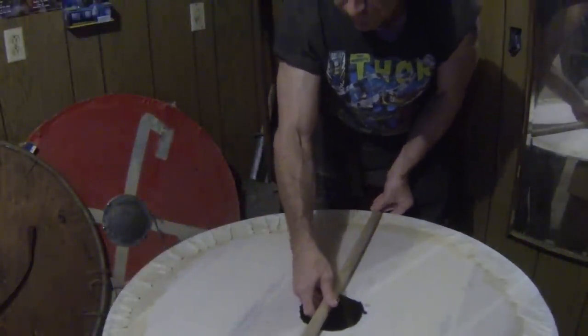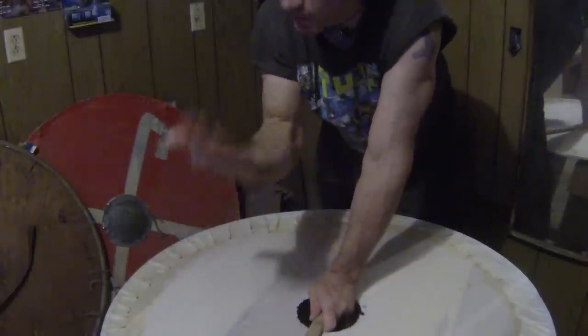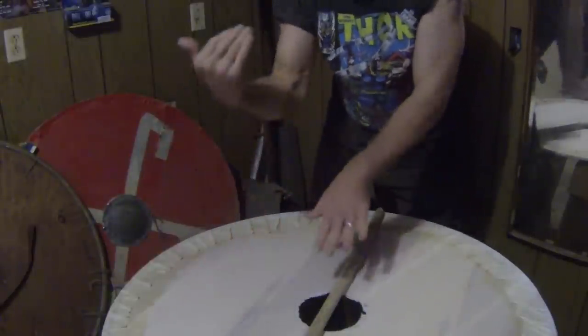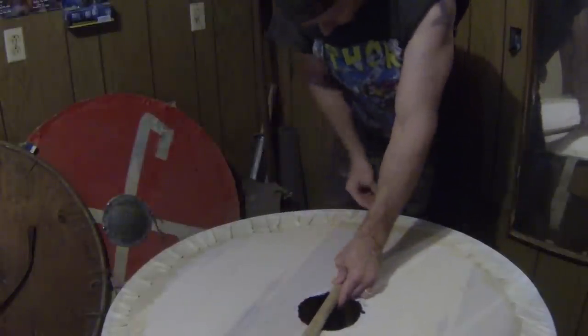And you've got the handle somewhat sunk in. You don't want to take quite half off, just enough, because you still want all this strength to hold the slats from going this way, because this veneer will not do it, they'll break. So this has to go from top to bottom, especially on this design. This is your back brace and your handle.